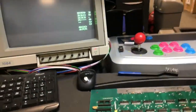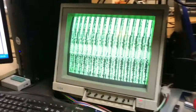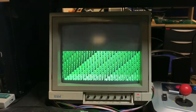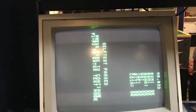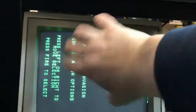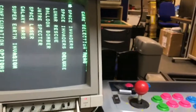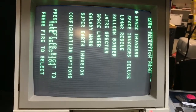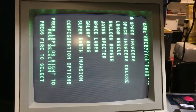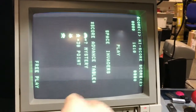Let's just reset that. There we go — it's still running. I'm going to give it one more reset whilst it's on camera. It's had a few minutes to warm up — according to the counter on the phone, we've been running this clip for six minutes. And it boots first time. It goes through its tests. Now, the only thing that's interesting about this particular board — all the other Space Invaders boards I get, the screen is the other way around when they come to me, but this one is this way. I wonder if it's the upright version it's supposed to be this way around, and cocktail mode starts the other way around. Worth having a look at the dip switches. But anyway, we now have a working Space Invaders game again, which is going to be at Leeds this weekend.